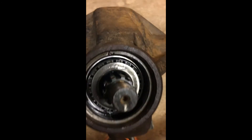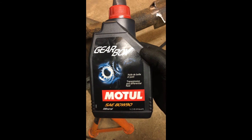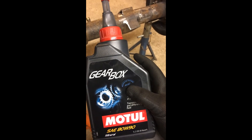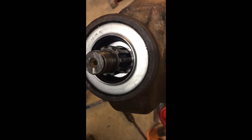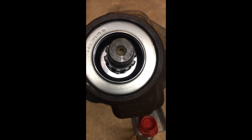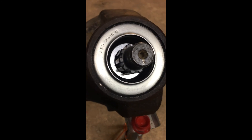I've poured on some of the oil I'm going to use — this is Motul 80W90 mineral oil, fairly good quality and it contains MoS2 — molybdenum disulfide. Now I'll put on the oil thrower, put the paper gasket around the edge, and tap in the new oil seal. I've got the new rubber seal in, which looks pretty substantial in there. Now I just need to pop in the input flange and hopefully preload the bearings again by torquing down the main pinion nut, putting it back in the position it was in before — fingers crossed.